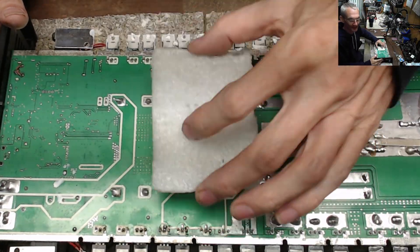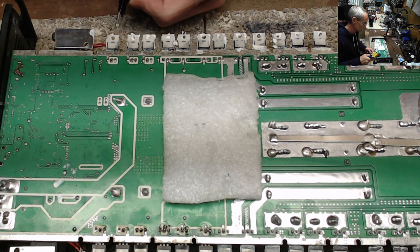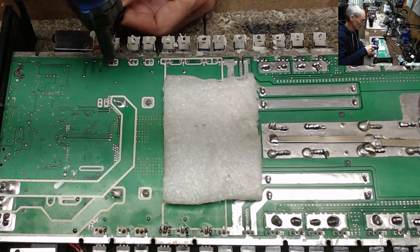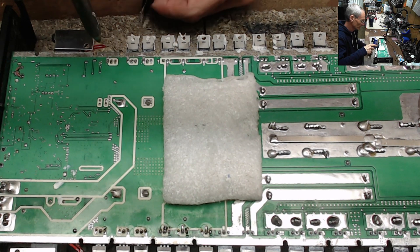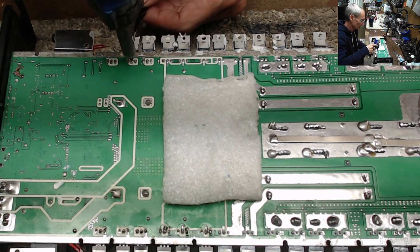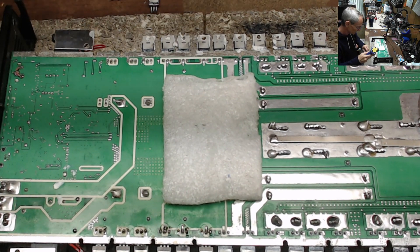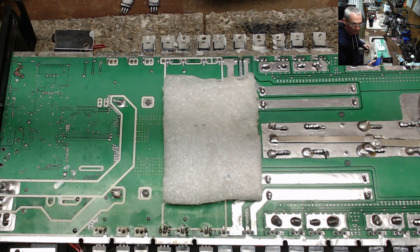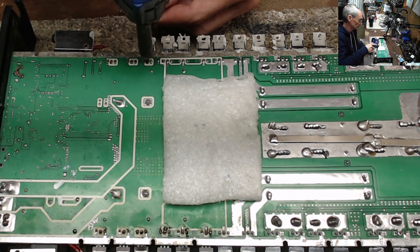On my mat here — this is what helps keep the board from bowing in the middle when it's flipped around. I do not like to put stress on PCBs because the traces can go bad. I'll bust out the FR301 and remove the three low-side transistors. These are the IRFB4115s — IRF B4115, yes. Sorry, I get in a bad habit of just calling things 4115s or 4127s or 4227s, but hopefully people understand what I'm talking about.